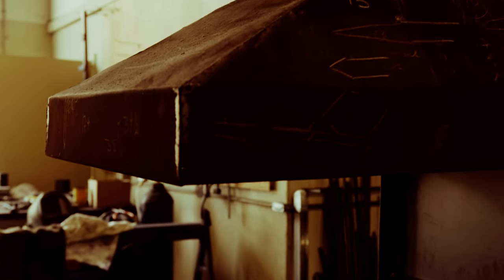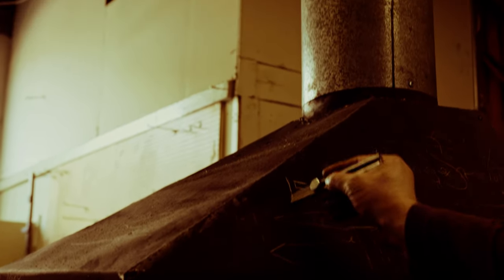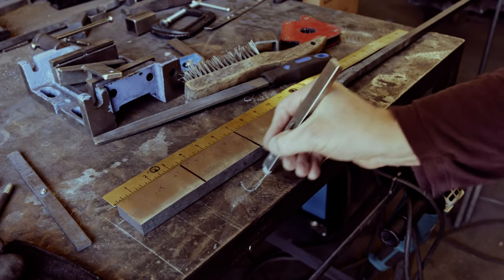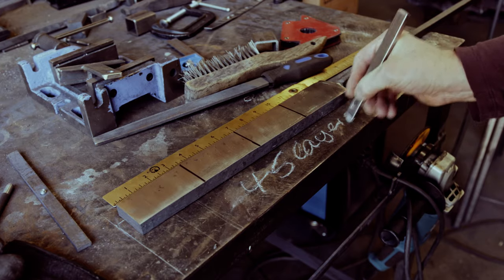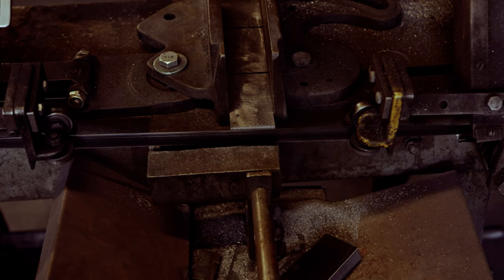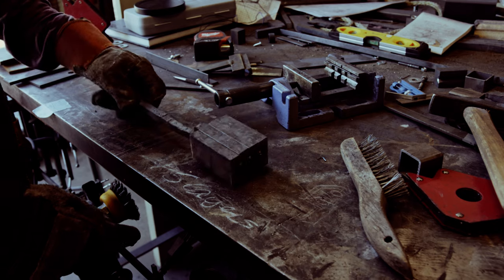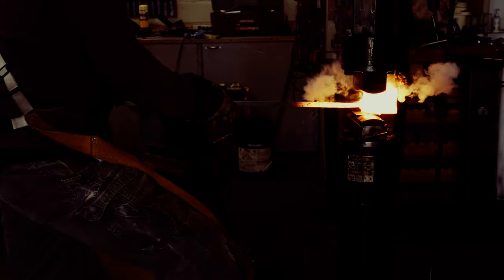I am trying to keep track of the layer count. I am at about 45 layers at the moment and will cut the billet into 4 pieces to get up to about 170 layers. You may wonder about me saying 'about' so much when talking about the layer count. I kept 1095 on the outside, and in each stacking operation there will be 2 layers of 1095 where the pieces meet, and thus no visible increase in layers there.